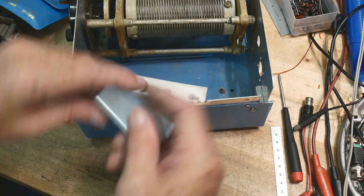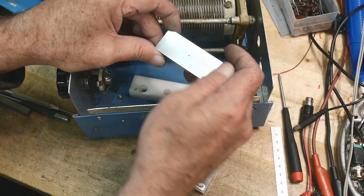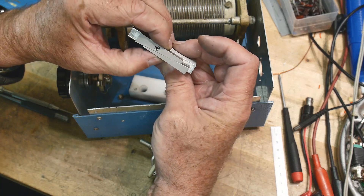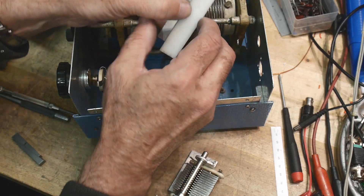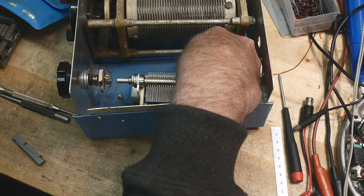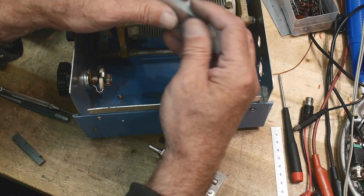Here's my machining. I've got a nice facing end mill — I use my two-inch facing end mill and it cuts very clean on aluminum. It is exactly the thickness of my gauge, which is great. The way this is going to work: this piece will mount to this piece with two screws that hold it, but first this mounts on this, so there'll be some counterbored screws to hold it. Then there'll be some tapped holes in this one and it'll go on — and it slides right in there. Perfect fit. The capacitor can rotate. Great.